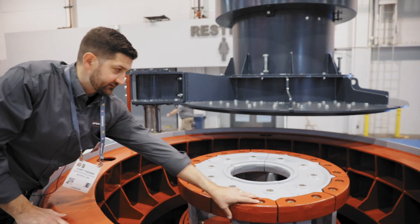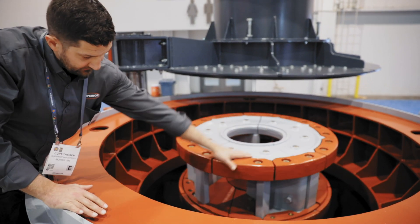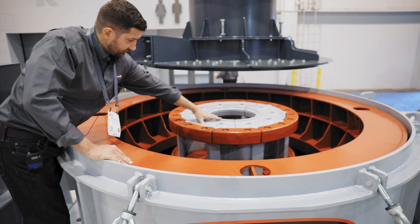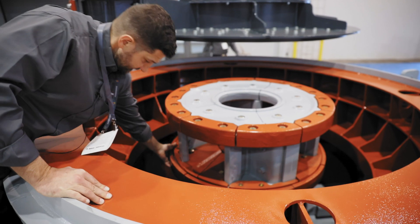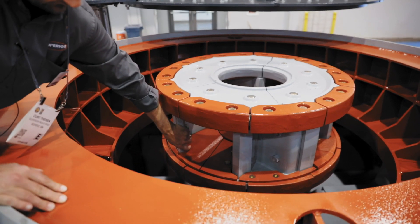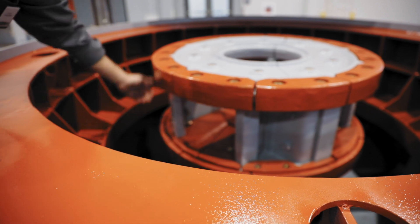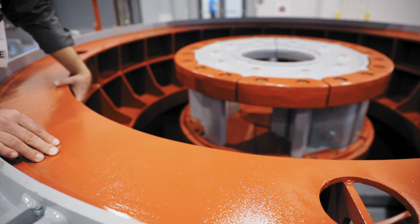You can see here, this is our four port enclosed rotor. Every square inch of this is filled with wear parts to protect it from the material flowing through the crusher. We have our edge liners, our top cover, our lower and upper rotor liners, and also our tungsten tips — there's a tungsten inlay that is very abrasion resistant. These parts really hold up to the abrasion wear of the material sliding through the openings in the rotor port.